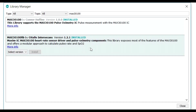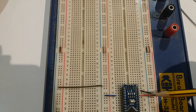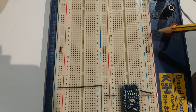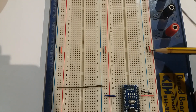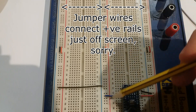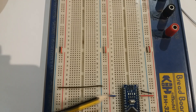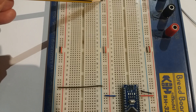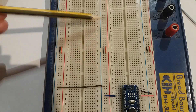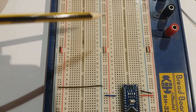First step: we've got the Arduino on our board. Connect the Arduino's 5V to the positive rail and the ground to the negative rail, then make sure that all over the board you've got access to those rails by putting jumpers across so the power and ground continue along. I've got jumpers going down and across so I've got every rail common — I can put components wherever I want and always have easy access to ground or power rails.